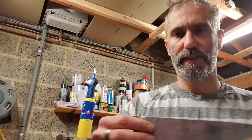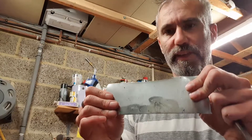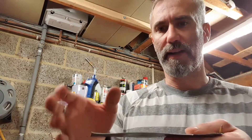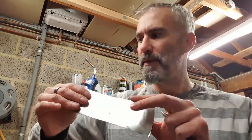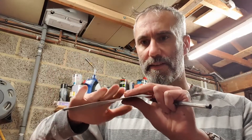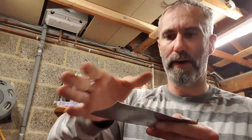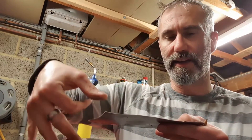Welcome back to the channel. Today we're going to have a look at metal shaping — taking a flat sheet of steel about one millimeter and turning it into a bowl shape. Fundamentally, whenever you're doing any sort of metalwork, you're either shrinking metal or stretching metal, and that's how you get it to form into shapes. Where it gets more challenging is compound curves — a bowl whereby the metal curves up on all sides.